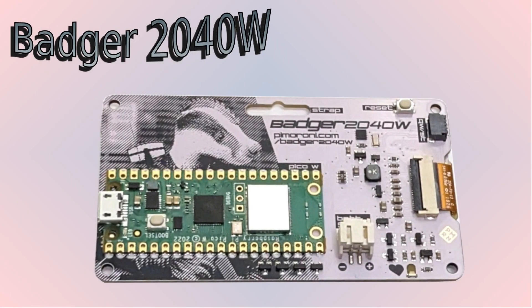Turn it over and the differences are much more obvious. The Badger 2040 had the RP2040 microcontroller directly on the PCB, but the 2040 W has an entire Raspberry Pi Pico W soldered on the back. This is the first time I've seen the castellated PCB connections put to use by soldering the Pico directly onto another circuit board. There is an obvious colour difference between different printed circuit boards, but other than that I think it looks great, and it works really well.